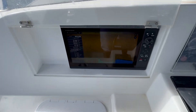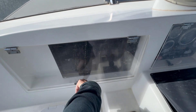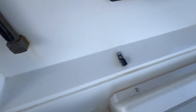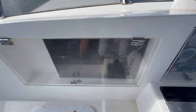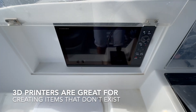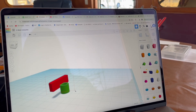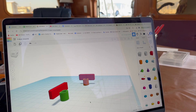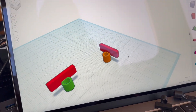We put this new screen in on our flybridge, but it has a door and the door should close here — this little latch piece should fit into something like that. Because that screen is too big, I had to design a custom part. The designing process takes some knowledge of CAD software, lots of careful measurements, and often a few prototypes. For this latch, the hole was initially too big, so after I printed and tested it, I went back and adjusted the size.